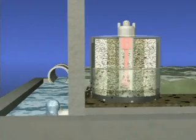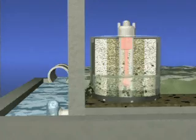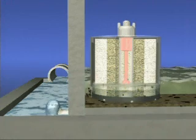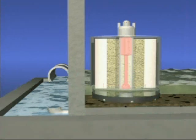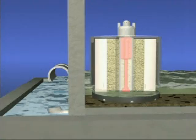As the water in the vault continues to drop, air bubbles rush through the regulators into the cartridge. As the water under the hood is released, the bubbles agitate the surface of the filter media, causing much of the accumulated sediment to drop to the vault floor. This patented self-cleaning mechanism also increases the effective life of the filter.